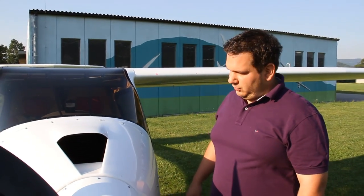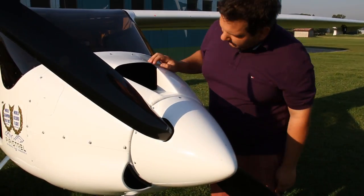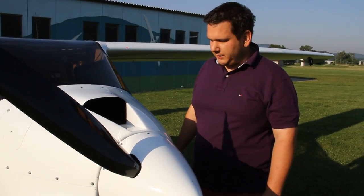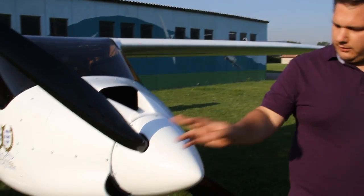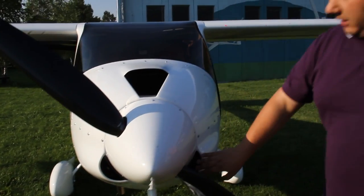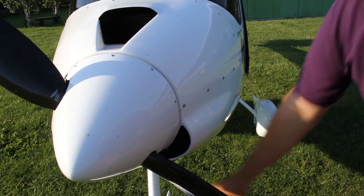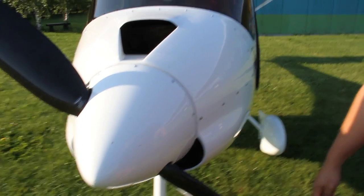The first station is the engine cowling. It's a pretty straightforward thing to do. The engine cowling has three openings: the one on top serves for cylinder head cooling — there's a radiator in there and you have to make sure it's clean and not damaged, as dust or insects can contaminate it. On the right-hand side is the opening for cooling the cylinders, with an air duct — also make sure it's clean. On the left, the airplane has a smaller radiator which serves to cool oil. The Alpha also has one extra radiator on the bottom where the oil cooler is.